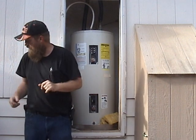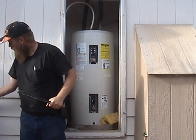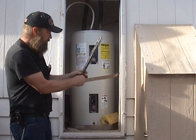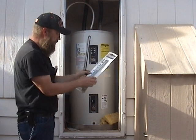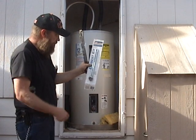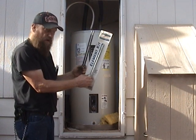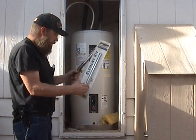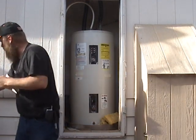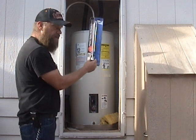Now you can go one step further, and I do this myself somewhat often. Here are your basic elements that go inside your water heater. This is a fold-over low-density water heater element, and this is a high-density element — it's a very long, very durable, and more expensive element. Both of these are in the 4500-watt range. For the second stage of saving money, you really can't use these — they're too slow. What we do is move up to the 5500-watt element, which produces a lot of heat in a very short time.